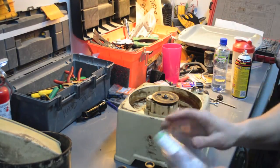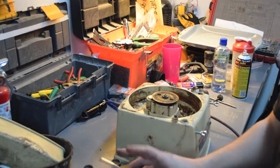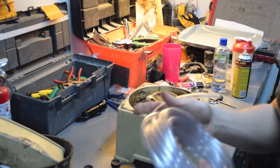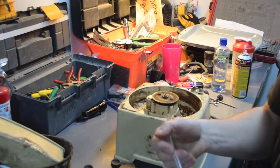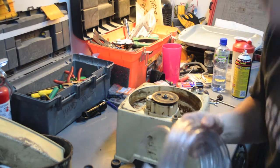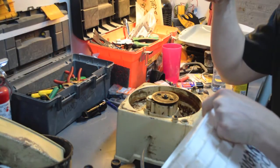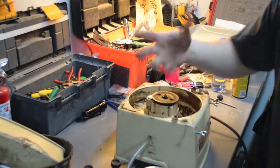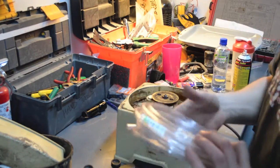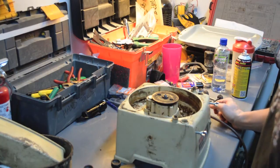So I went and picked up some tube from the local big box store, and at first I was kind of annoyed that they didn't have a shorter piece. All I wanted was 6 inches. I thought I just wanted something to drain out. But now I'm really glad that they only sold it in this 20-foot length. I don't need 20 feet, maybe 6 or 8 feet. But I think I'll leave it at about an 8 or 9 foot length, so I can actually put it through here and then drain it into a bucket. I'll uncoil this, put it in a bucket, and that way all the water's contained and should be draining through into the bucket. When I'm done, I'll just dump the bucket out, clean the machine, and we're good to go. So it actually worked out better with the long tubing. I didn't think about it before. The tube itself was like $3 or $4, but that's going to work wonders for keeping this thing as clean as possible, because it's a super messy machine, but it's awesome for sharpening with.